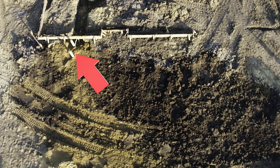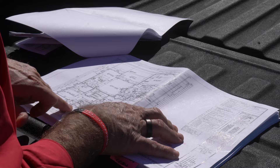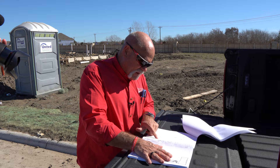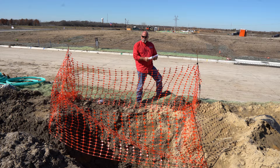What I would do with this drawing is look at where my two-way clean-outs are out front and where I'm going to rough in. So I'd look at where I want to bring in my sewer line — run a full four-inch line in under this bathroom and go to everything. This is also a two-story house, so it's got a three-and-a-half-inch drop right here — they've already planned for the upstairs to come in off that line, and another three-and-a-half-inch drop for the other bathroom. Let's go walk the rough-in and see how it looks.